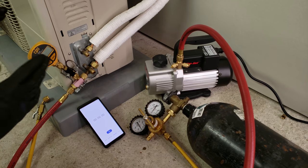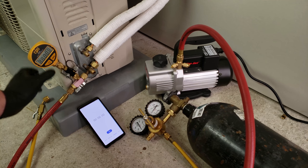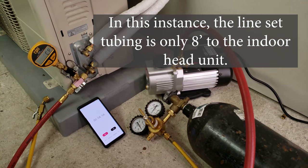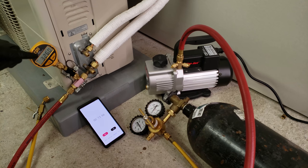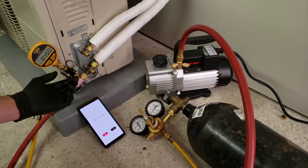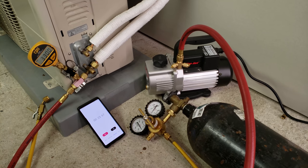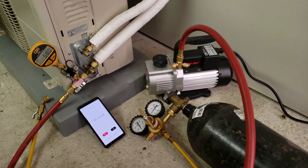The first thing I'm going to do is a single evacuation first and show you how to do a standing vacuum test. I'll go ahead and turn our vacuum gauge on and start our timer to see how long the vacuum takes. You really want to get a vacuum down below 500 microns. The vacuum gauge will show you the vacuum level. You might have a little bit of air trapped in these valves, so I just close and open them while the vacuum pump's running. You want to make sure you get down below 500 microns and stay below 500 microns during the standing vacuum test.